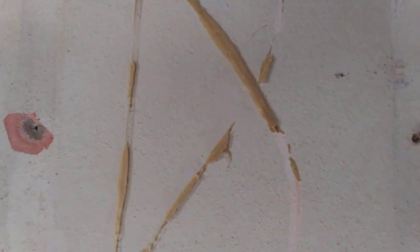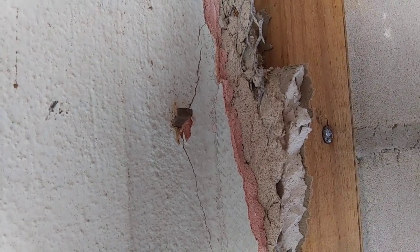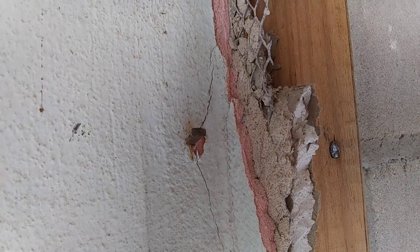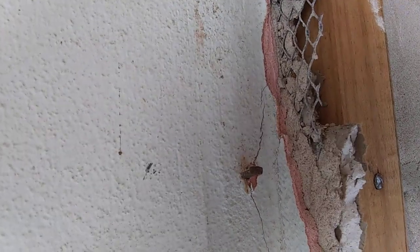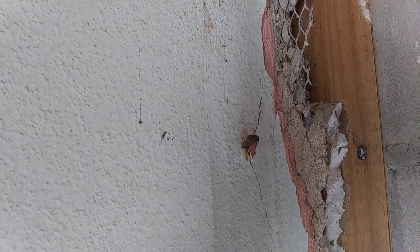The initial builder was pretty smart — he used lime wash. You see this pink thing? That was lime wash. Lime wash was wonderful because it kept the wall dry, it prevented mold formation on the surface of the wall, and kept the wall in absolutely perfect condition. But then these folks decided to apply acrylic paint onto this wall and then sealed it with drywall, and all this moisture trapped inside the concrete block had to find a way to get out.